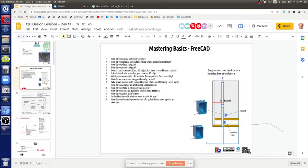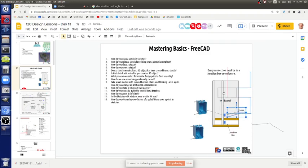So you got your studs. That means you determine the position of this outlet next to this stud here, both of them. You've got to attach them. That's where they're going to be. So Matt, why don't you do the bottom junction box? And when you said there was a 14 inch cavity, what is the cavity you're referring to? The spacing between the studs.